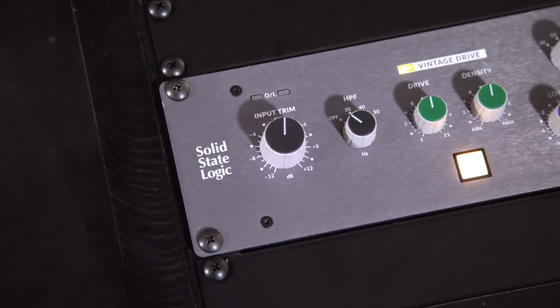What's the makeup of the unit? What are the individual parts that create this Fusion? Right. So starting with the input-output stage, we stuck with what we do really well with the 9000 series super analog circuit. We've added a very clean input stage, a very clean output stage. Input, obviously, you want it to be a perfect mirror image of what's actually happening outside the unit. And of course, when you're introducing all this extra gain inside the Fusion, you want to make sure that the output bus is handling all that. So there's a lot of input gain and output gain available with those super analog portions.